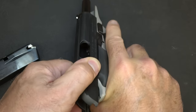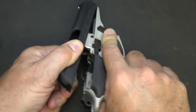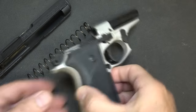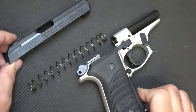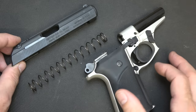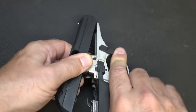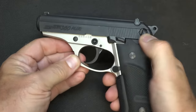Let's go ahead and drop the magazine and disassemble the firearm - the gun is unloaded. First thing we want to do is bring our takedown lever around, then bring your slide back and lift up from the back. This is going to bring it loose - sometimes it will take a second - to pull it loose and get it over this barrel hood. Here we go - we've got our recoil spring and guide rod. It is a fixed barrel design, so the barrel is attached. This really aids in accuracy, especially like with the Walther PPK and other blowback designs - it's a very stable but very simple system. 380 is the highest caliber that can go in the blowback action; once it gets to 9mm the pressures are a little bit too high. That's all you need to do to field strip. To reassemble, just bring back your recoil spring and then your slide, bring it all the way back making sure your takedown lever is down - and you're back in business.